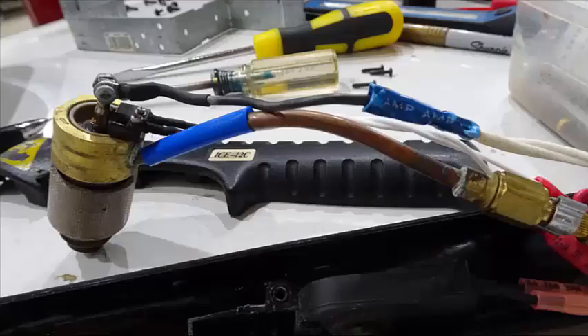Here's a picture of a commercial torch head which has a micro switch. The anode pin actually gets compressed when you screw on the gray outer cup — that pushes the pin back, closes the micro switch, and enables the machine. Notice the anode is the black wire tied to the end of the anode plunger. This is a safety feature so you can't try to turn it on when the cups aren't in place.